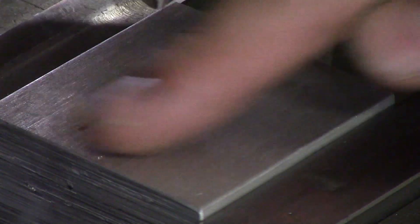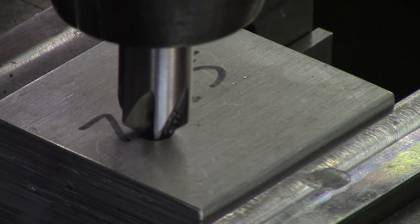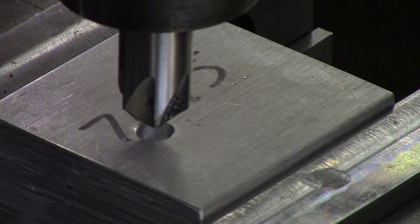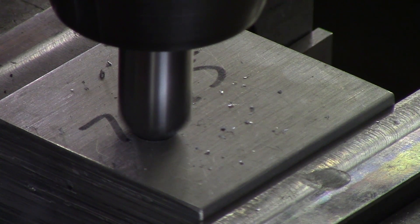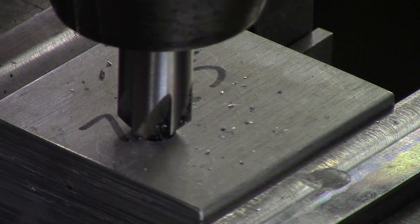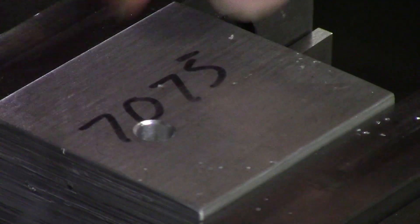The first thing you want to do is barely touch the hole — turn the spindle on, cut a little bit of material, then set your quill stop so that when you bring the quill down it hits the material and the stop at the same time. That way you can bring your knee up accordingly. Turn the spindle on, come down and barely touch, then turn it off, get a quill stop, and put it up against the quill.